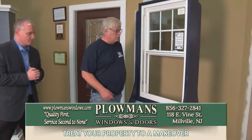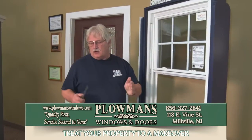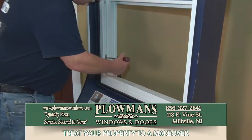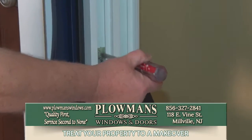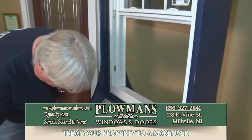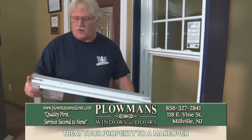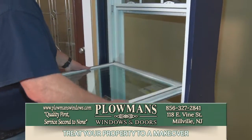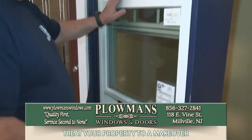This will represent to you as if your sash went bad, you cash and carried your windows and wanted to put this in yourself. The important thing is that we've already removed the old sash, and this is showing you how the balancer system goes so the sash can go in. The bottom of this sash has both its pivot bars on it. So basically, all you're doing is taking it, dropping it in, rocking it, and bringing it to the up position.